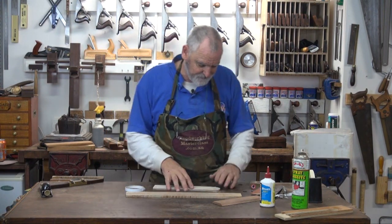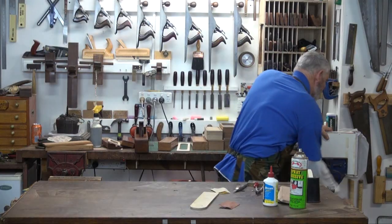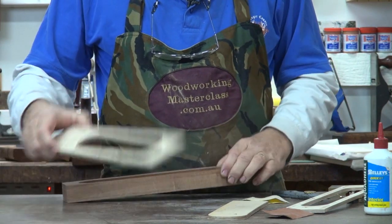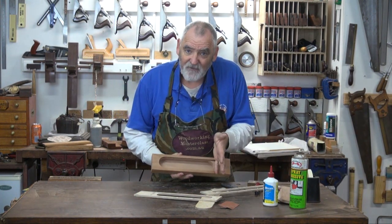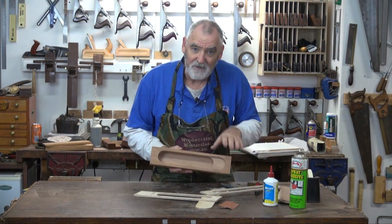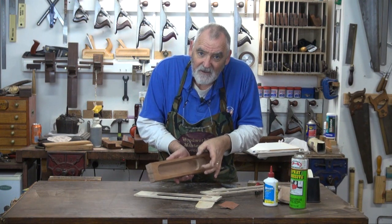Alright, I'll go and make another lid. I've just made another top so now we've got a contrasting top or we've got a top out of the same material. Should be drying out. Take that out of the clamps and now you can see why we had the longer template. If I'd had it at this size and not the longer one, and we'd cut it off here, when I tried to put it over the router to route that groove in it, these parts can come apart. So it's a lot safer to have it in one piece, and then when you glue it to the actual body of the pencil case you're gluing one full section and these end bits can't come off line when you clamp it.